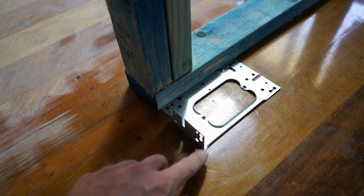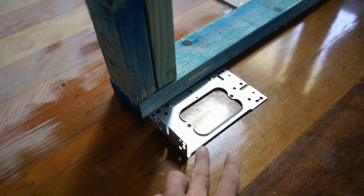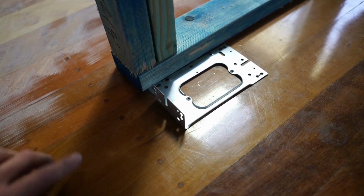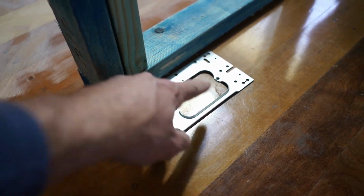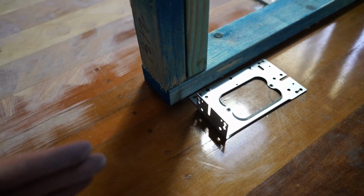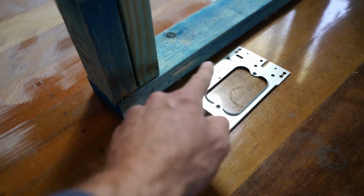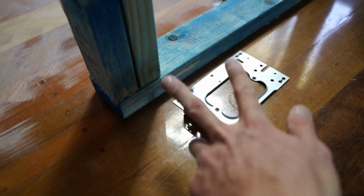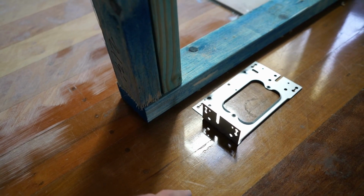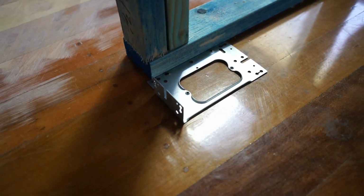The next step in the finishing process will be I'll put some architrave down this side, which will hide anything underneath it. So the cement sheet's going to be notched around this edge, and as long as it comes back just enough that it can be hidden, I can get that aluminium angle for the waterproofer to come back and go maybe even past that stud a little bit and then go back. Then if I put the architrave up on this front edge, you won't be able to see the end of that aluminium angle. It'll be covered by a piece of architrave on the edge of the cavity slider.